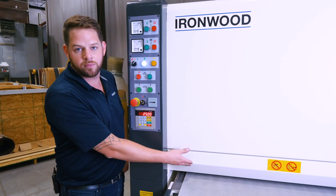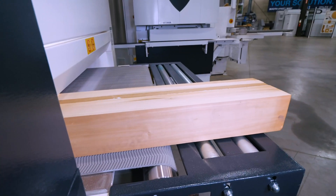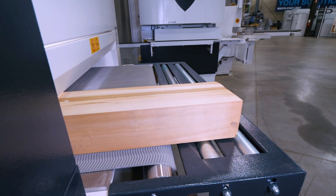Below here, you'll see the over-thickness protection bar as well, meaning that if I feed any piece through that's too thick for the machine's calibration to handle, it will automatically trigger the e-stop, protecting the interior components of the machine from damage should the workpiece be too large.